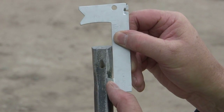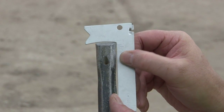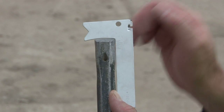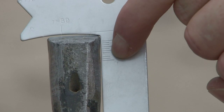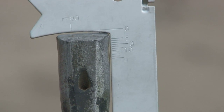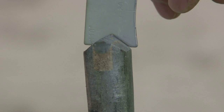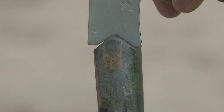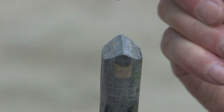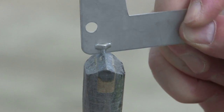Check the top of the tool — put the tab on and slide it down. That shows the curve at the top is correct and not over at the corners. The graduations, measured in millimetres, show the limits of wear at the edges, which is three millimetres. To check the point of the rock drill, the tip should fit squarely into the V shape. To check the actual tip itself, put the slot on the tip and it should fit over the point of the tungsten carbide bit.